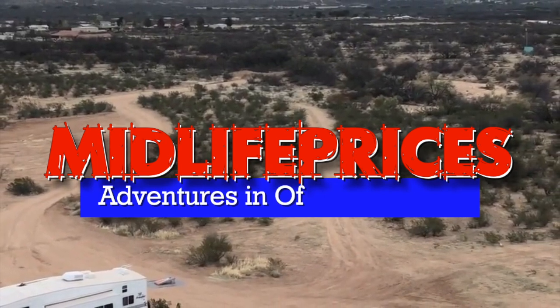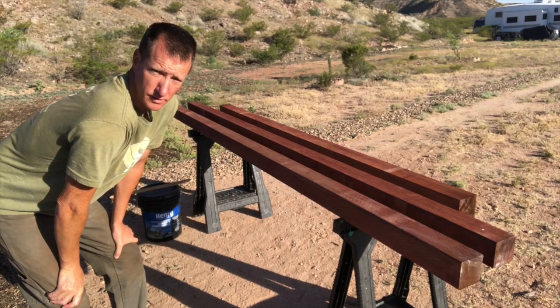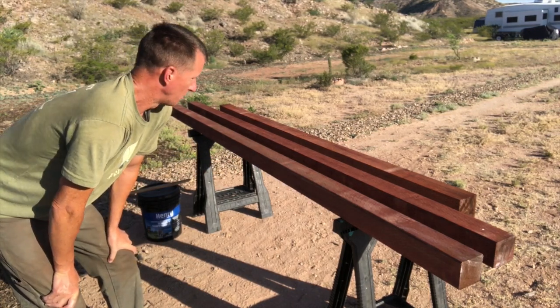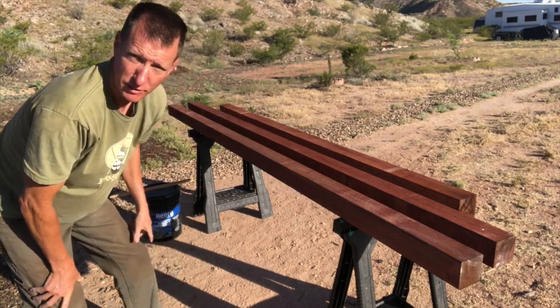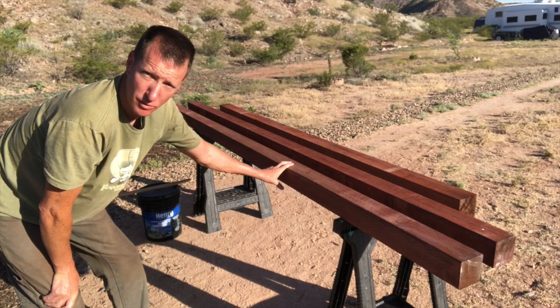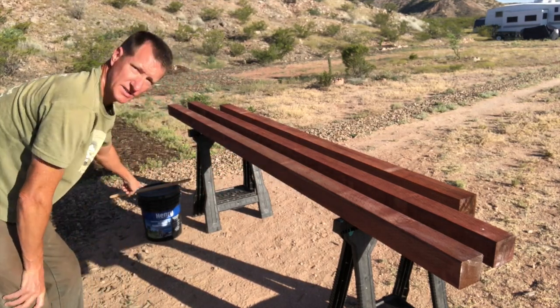Hi, I'm Brian DeFleur. Here are corner posts for the solar mount. You might know why there's three if there's corner posts. Two of them are ten foot long and one of them is eight foot long. For the front post, I'm going to use that eight footer to cut it in half for two four footers, because they're going to be short for the front post and tall for the back post. These are four by fours and they are treated.